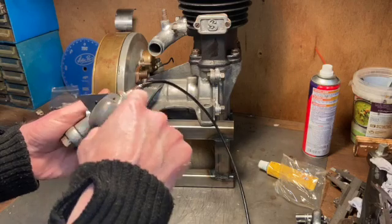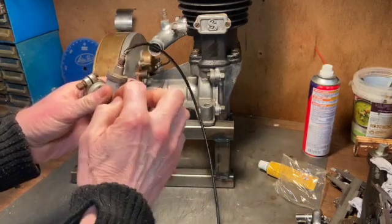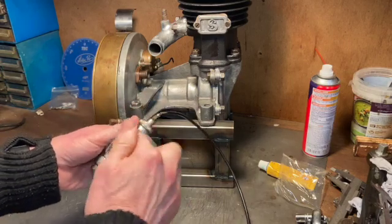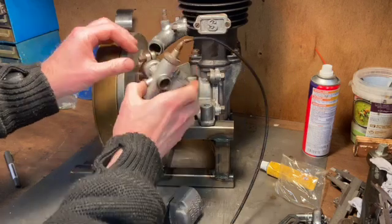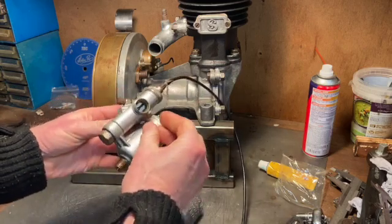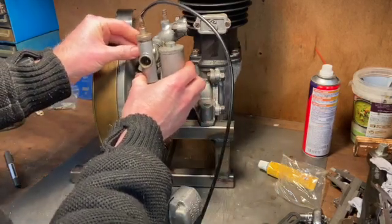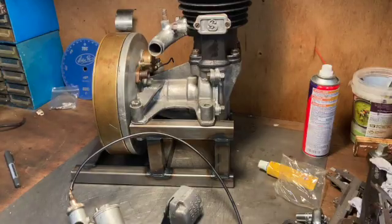It should work. This is a little shroud that screws on - it's there so water doesn't fly in, doesn't really matter on this so I might cut that off. This lever is a very simple choke mechanism which I might keep. The only slight snag is that the fittings are very similar but not the same. I was considering machining that out but this body's made of steel and it'd be a bit rubbish. So what I'm going to make is a male-female adapter - a thing that slides over one end and slides into the other - made out of aluminium.